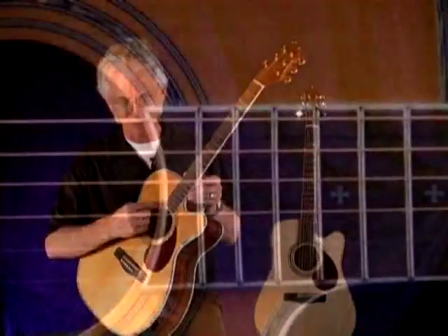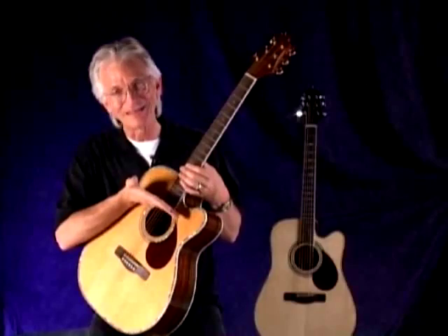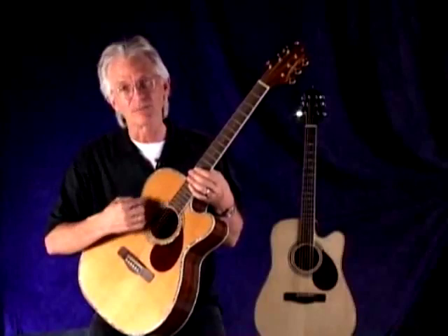As we get down to the body, I also like to round off the bottom of the fingerboard so it matches the contour of the sound hole. It's interesting — once you get used to this treatment, when you look at guitars where the neck treatment is square across the bottom, you start to wonder why they didn't finish the guitar. You'll also note that every model we make has an abalone type rosette around the sound hole.